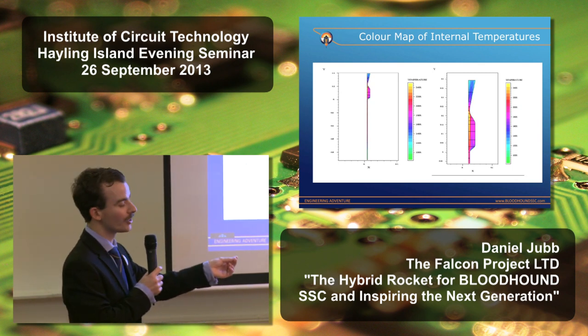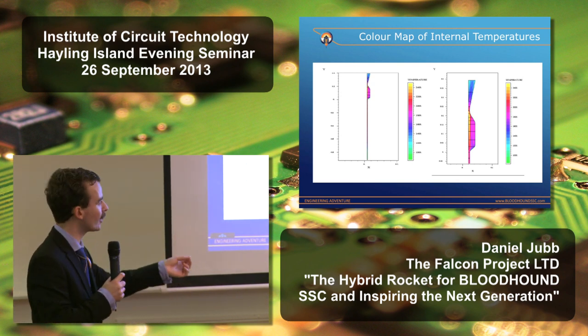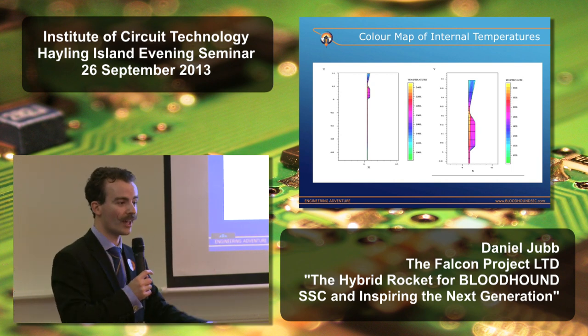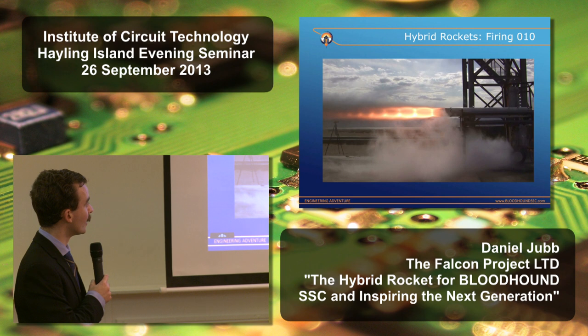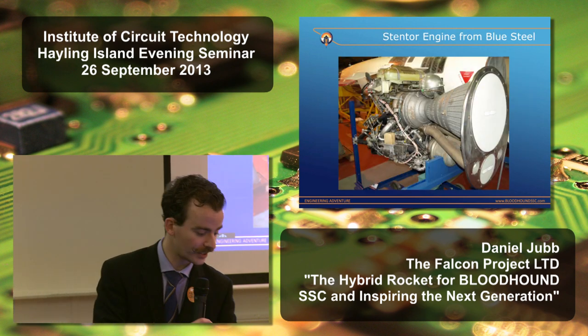The model helps us to understand that, and this is a plot of the internal temperature. We could look at that for gas velocity, gas composition as well. And we tried something that was totally new in hybrids. We actually varied the composition of the fuel grain along the length to match the local dynamic conditions in the chamber, and that really helped boost performance. So that's the 10th firing of the 6-inch chamber. We've actually done one fire instance in the UK.